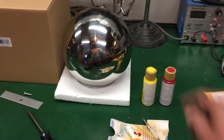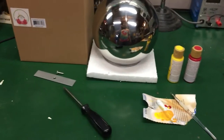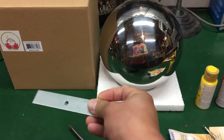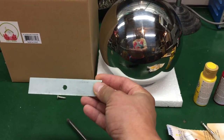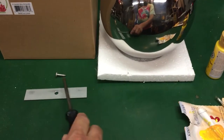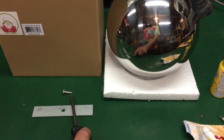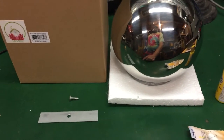I have some paint so I can do a little bit of touch up on the top. I took a piece of 1 inch flat iron that's galvanized, cut it to 5 inches — 6 inches would work as well — and drilled a quarter inch hole in there, filed off the edges. I'm going to be using a 3 quarter inch by number 12 screw to attach everything.